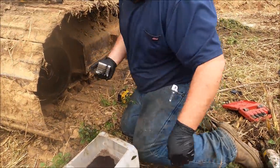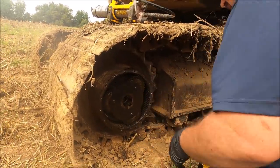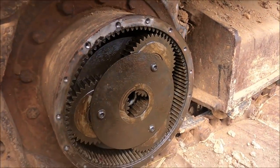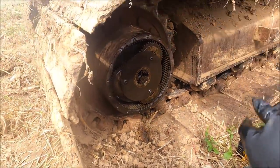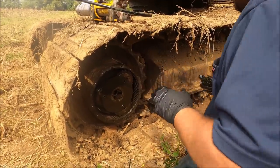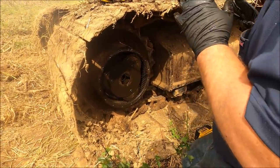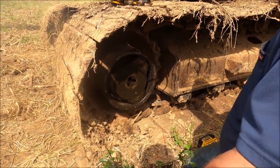I like this gear took the brunt of the punishment. We just slid that set of gears in here. We gotta take this plate off and go through this whole rigmarole of cleaning out the bearings one more time. Get this set cleaned out, and our shaft will be ready to slide in. We gotta clean our outer ring here, where we can slide our outer cover in, put our gear oil in, and this will be operational.